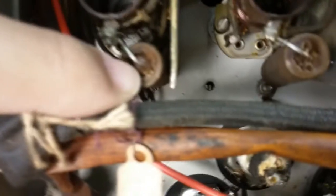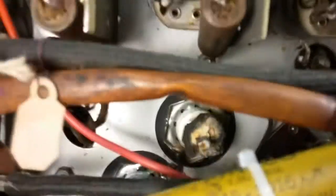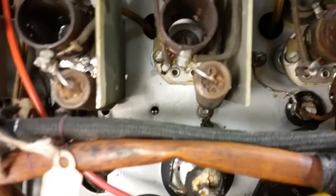These are the coils, and on the top you have the capacitors, so your inductors and your capacitors. And you can see how the end of these capacitors has opened up and the wax has started bleeding out. This one got pitted, which is really strange. That's kind of normal damage, and this one hasn't leaked yet. And I would imagine that that's from heat, and when this chassis is laying down, they're standing vertical,